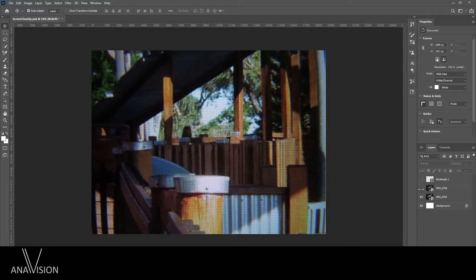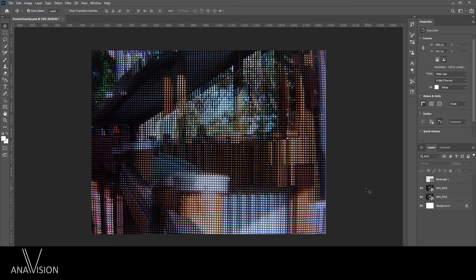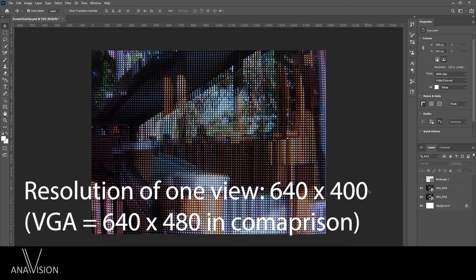Let me switch on that layer. As you can see, there is an obvious difference — it looks quite different at this closeness. One thing we notice straight away is that it does look a lot more pixelated, and that is actually true. You're now looking at the display with the light field switched on, viewing it stereoscopically. However, the sacrifice you're making is that it doesn't have the same high resolution anymore. The view you're looking at now has 1/16th of the resolution because it's generating those 16 views.